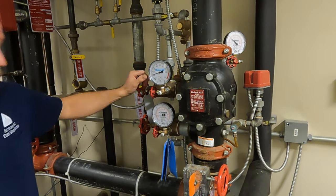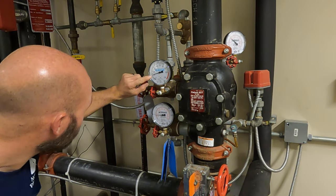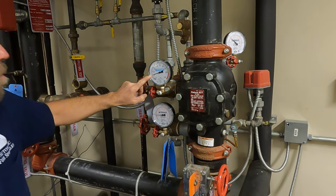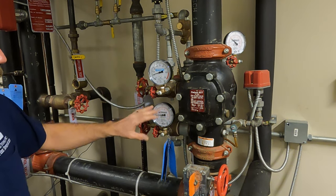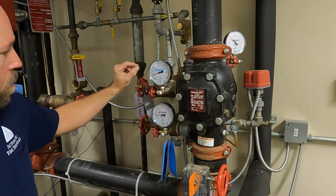I put the air gauge in and did away with the air-water combo gauge. We are at 12 pounds — the minimum is 13 on this. Those air-water gauges don't read as close. It's hard to see because on them this is 10 and then the zero range — the first reading is 10. It's hard to get them really accurate.